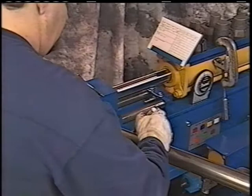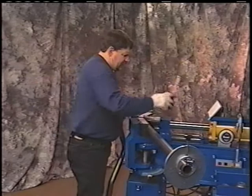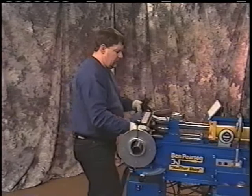The marker. We'll go ahead and measure from the center line of this bend, the center line of this bend, which is 12, and add it to the 8, which makes 20. So we'll want to mark 20 for our second bend. We'll go the length at 20. Okay? We're going to want to then back the machine up, center line that on the center of the dies.